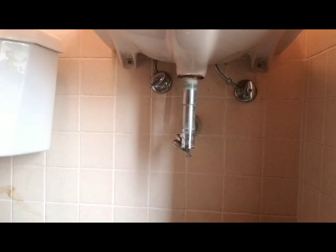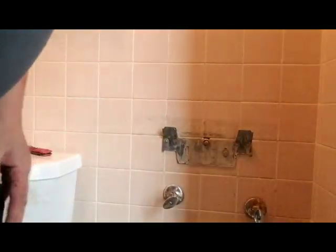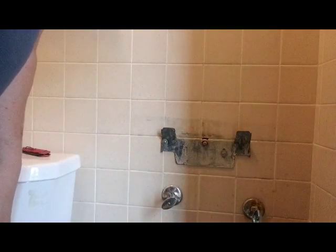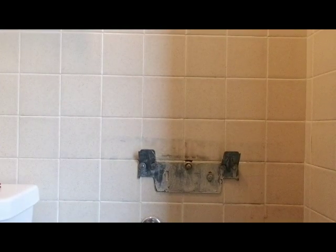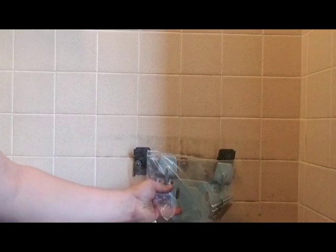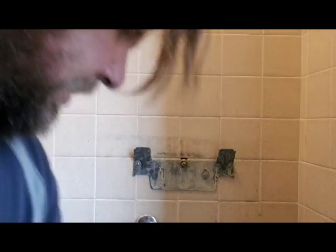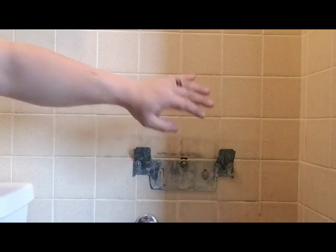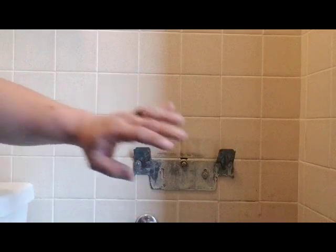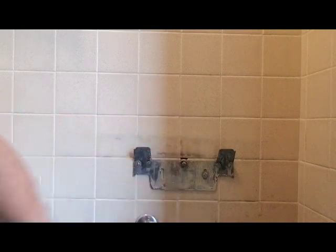When you reach a certain point, all you've got to do is pull your sink off the wall. Finish removing everything out and then we'll put the new one together. If the old sink was shaped a little bit different than the new one and you've got to replace the bracket, you will have to take your old bracket off the wall and mount your new one. If you're working with a tile wall like this, you will probably need a masonry drill bit. If you're dealing with drywall, regular drill bits will work fine.